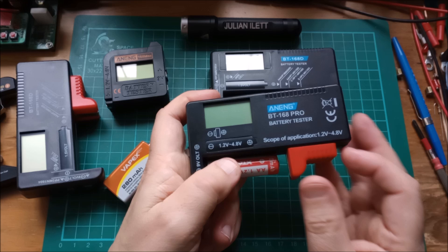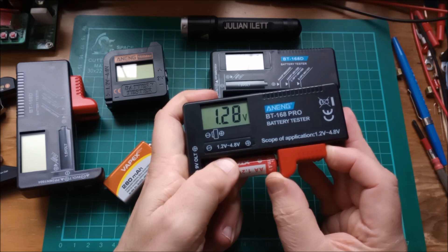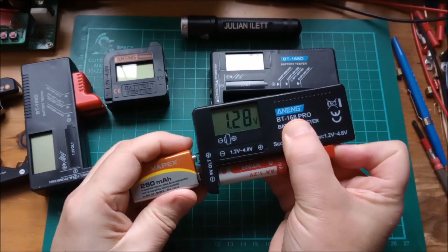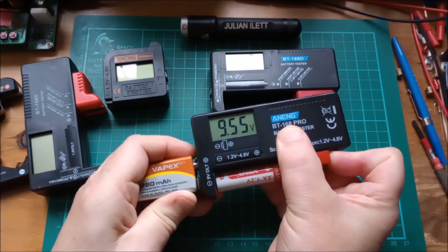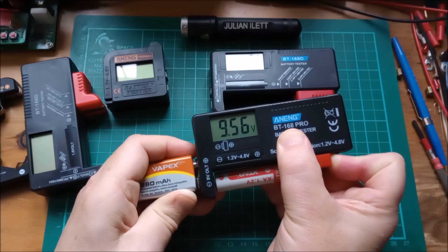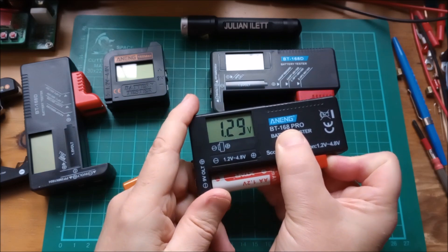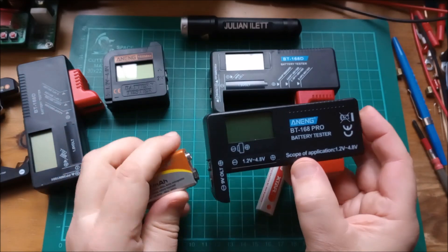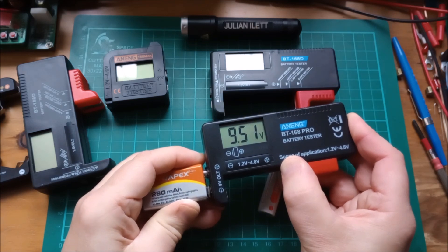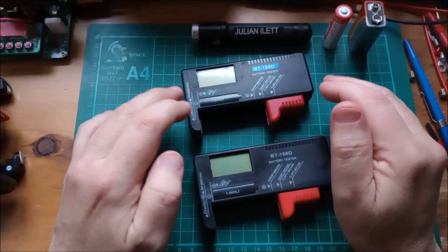So how do you know if your battery tester has this latching action? One thing I've found is that if you first put the battery on, you get an initial zero volts, then the real reading — 1.28 — and that is an indication this is a non-latching battery tester. Adding the 9-volt battery, it appears to be dioded into the supply, so it just overrides the 1.2-volt battery and takes the unit up to 9.5 volts — clearly a live voltage. That initial zero is the tell.